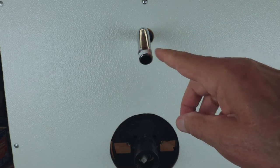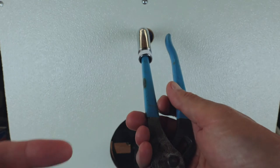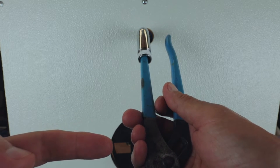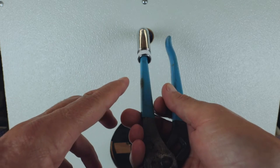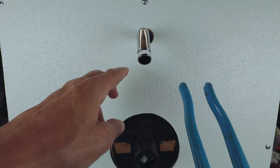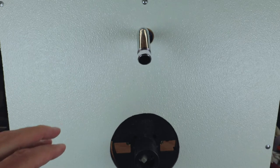Initially, what I like to do, when I'm putting them in and even when I'm taking them out, is put the handle of my channel lock pliers in there. And in a counterclockwise fashion, I will start to unscrew the shower arm. But a lot of times I get a lot of resistance and I don't want to force it too much, because sometimes that piece that's in the wall is not secured. Very rarely, but at times, I have snapped off the piece inside the wall. And if that happens, you're in for an expensive plumbing job.